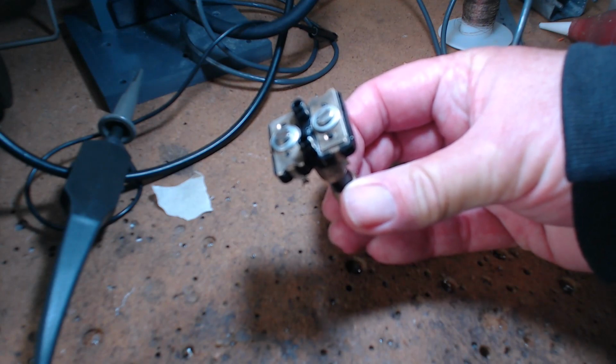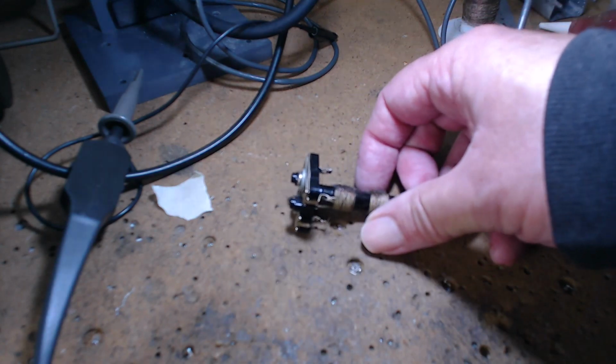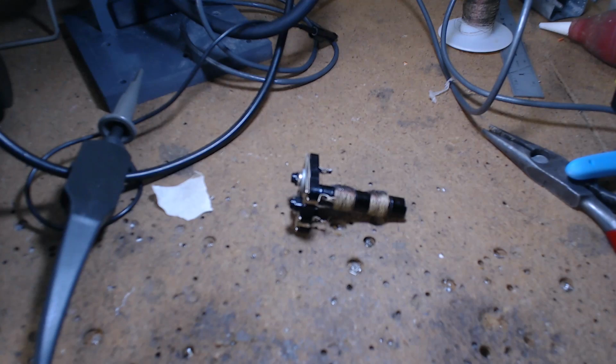I set it for the middle in the calculation for Professor Coil, and I know that when you put the IF coil into the case, it's going to go down in frequency because it's near metal. The inductance is going to go up and the frequency is going to go down. Likewise, when you add the coil into the circuit, there's capacitance from the circuit that's going to make the coil go even lower. So if you were to make an air coil, two coils together at 915 kilohertz, when you put them inside, you would lose your peak.